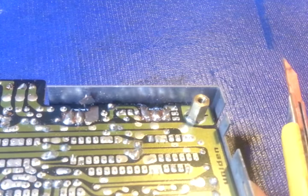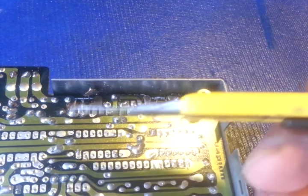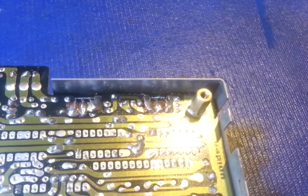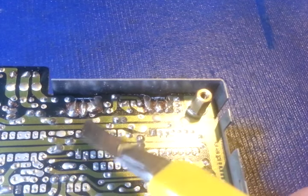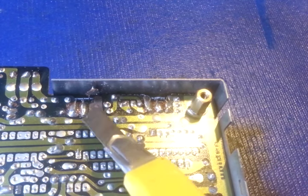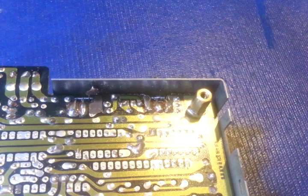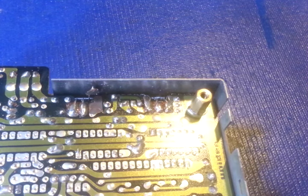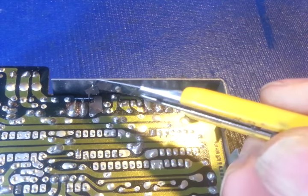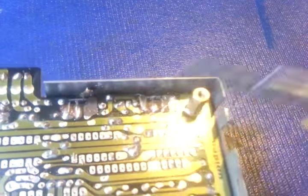And he said it's been erratic. It'll work, it won't, weird readings, and yeah, any problems in these counter modules can cause weird readings. Now the proper thing to do here to correct this problem is to clean off, because you can see that copper is supposed to be copper colored. Well, that does definitely not look copper colored. That's kind of a black, grungy looking mess.